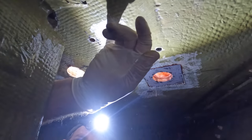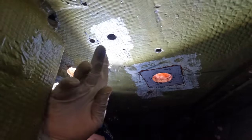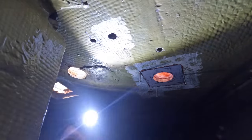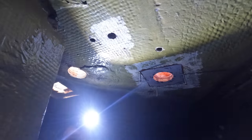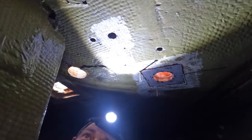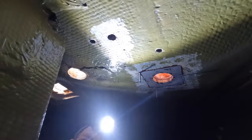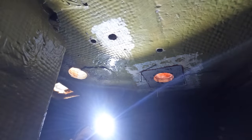And the actual bolt is a lot smaller than that, so I'm going to re-drill through the center of that, and that should give a complete epoxy perimeter around the bolt, which will have sealant. But if the sealant does fail, and at some time it will fail, it's only going to leak through the fiberglass and into the locker, so it should be fine.